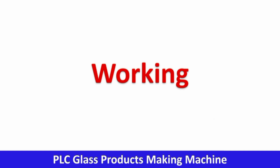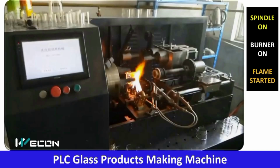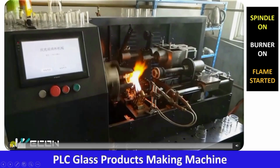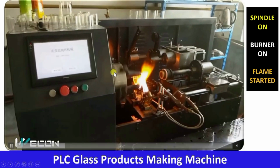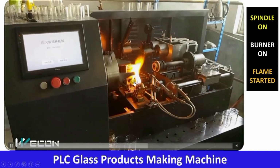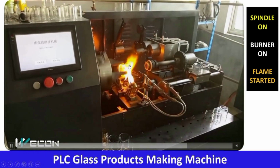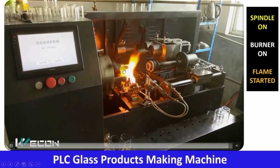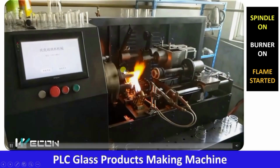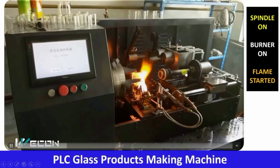We will understand the working of this machine. As you can see over here, first of all, when we place our product, this spindle will start rotating at the desired speed given by the user through the HMI, and the burner also starts. So it is heating and this is moving our glass object. So this is our first step. After that, observe this assembly.